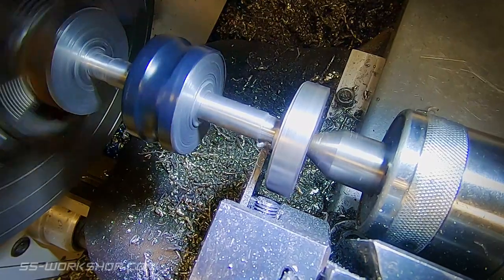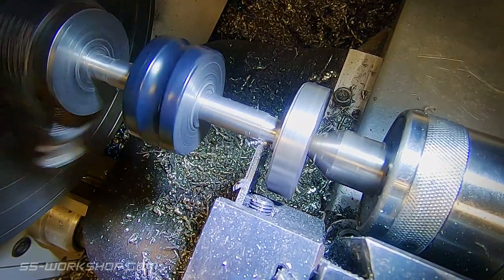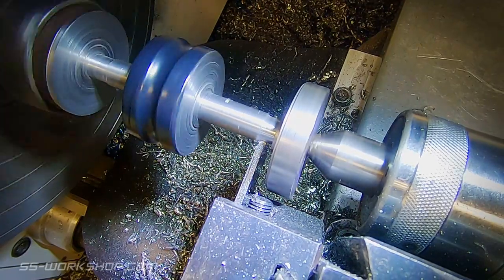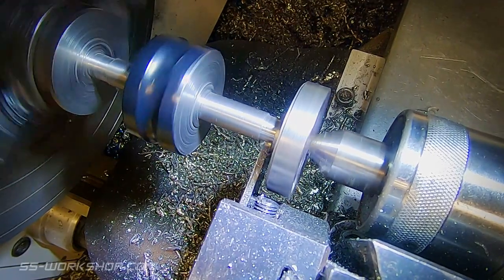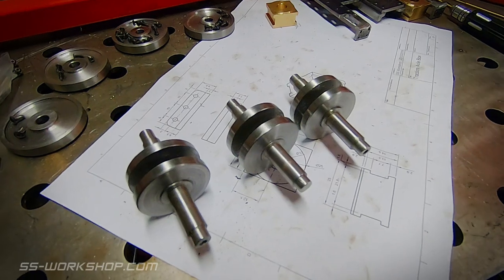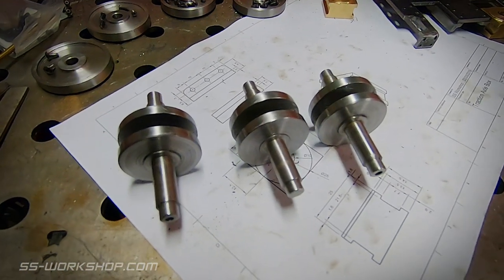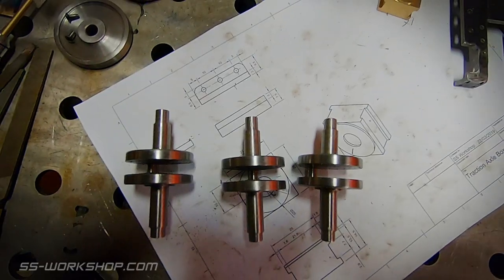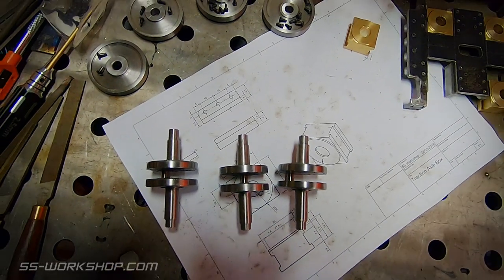Final reliefs were then cut on the ends of the shafts before parting the ends off. Most of the way I finished this up in the vice afterwards with a hacksaw. At this point the turning was complete, with one last process left - cutting the counterbalance shape. I did this using a hacksaw and then finishing it with a file.